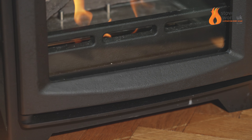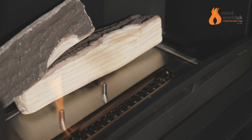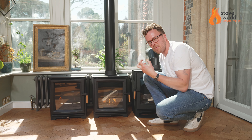The body itself is the same dimensions, but the key difference is the thickness of steel is thinner on the bio stove — which might seem a negative but it's actually an advantage. Because bio stoves don't give out the same intense heat as a wood burner, this thinner steel gets hotter quicker and is better for a bio stove. We've designed and made them to balance how it feels, looks, and performs — getting the steel thickness just right so it looks durable, is durable, and isn't too thin or too thick.